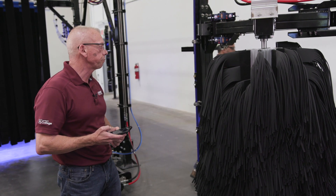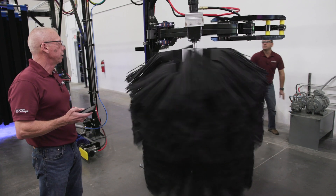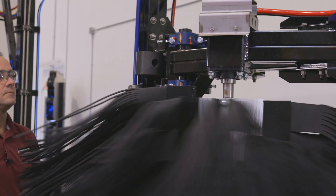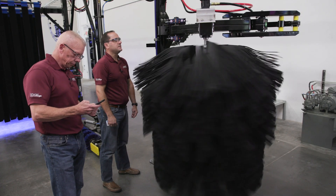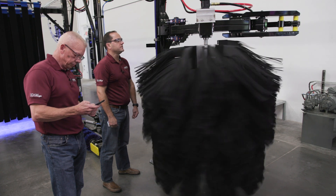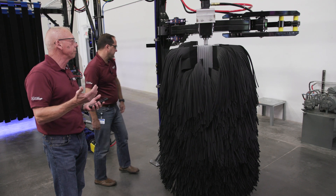George, will you turn it back on for us please? Vic's going to go over to the power pack and make the adjustment. All right, we'll see what that did. When I say go, start again. Go. Vic counts sixteen revolutions in fifteen seconds. Stop. Sixteen times four is sixty-four RPM, so we're still not where we want to be. We want to dial that up even further.